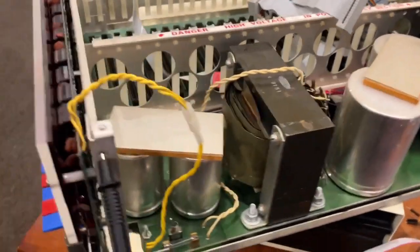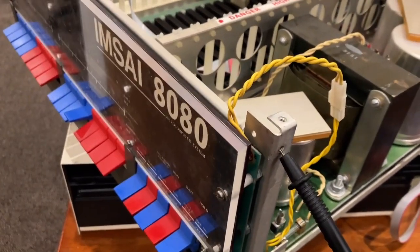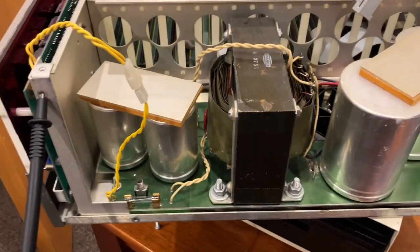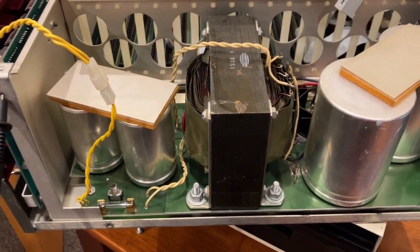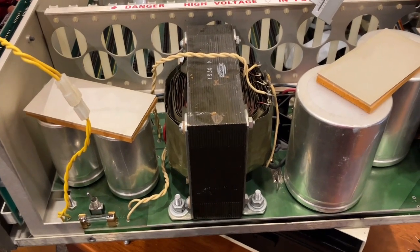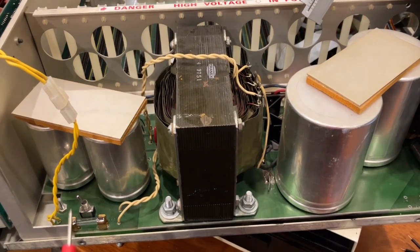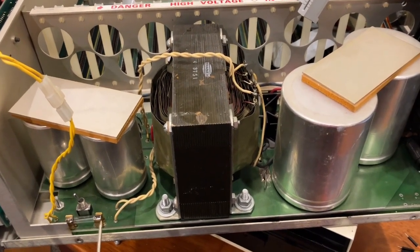Something is very wrong with the power supply to my MSI 8080. Notice that even though the unit is off, there are things here that are still energized. In particular, the fuse comes before the switch, so even with the unit switched off, this part is still energized.